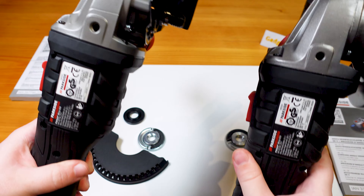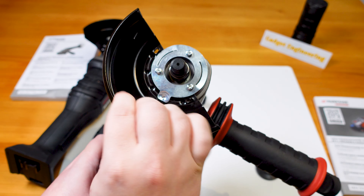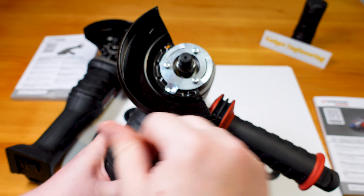What's also changed is the front spindle output area, which has changed construction a little bit. The newer tool has a spline arrangement to retain the shield with a spring clip, while the older version just had a screwed-on sheet metal plate retaining the protective shield and providing rotational articulation. Otherwise, the diameter ball bearing at the bottom seems pretty similar between both.